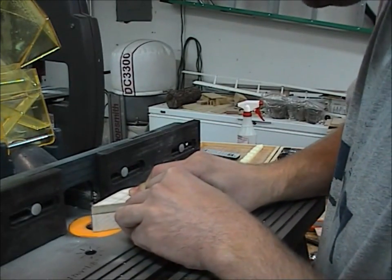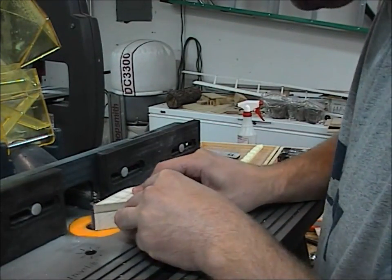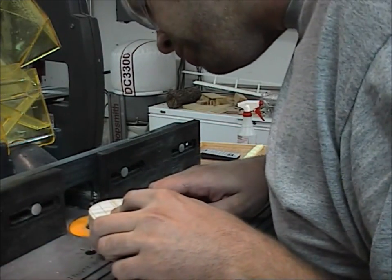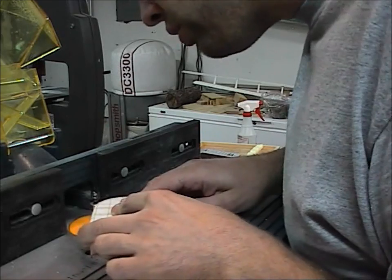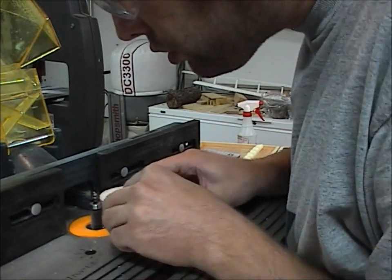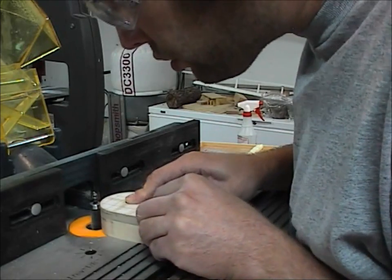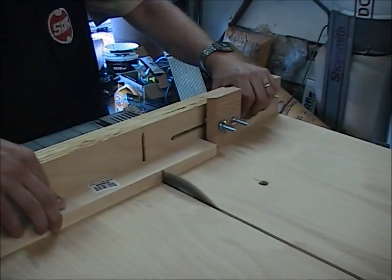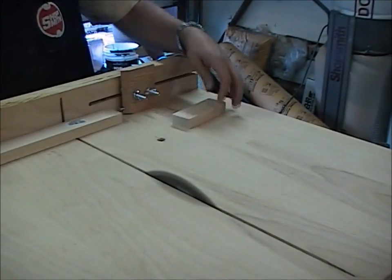I drilled a 1/4 inch relief hole at the end of each 90 degree cut, just letting glue squeeze out and escape. Although I'm using 1/4-20 hardware, I drilled the mounting hole 3/8 of an inch so that the whole thing would have just a little bit more wiggle room. I cut 4 long legs and 2 clamp arms to length from 1.5 by 3/4 inch birch.